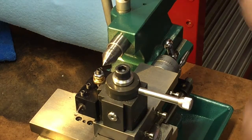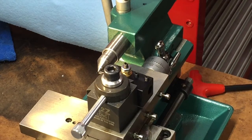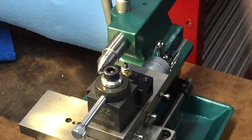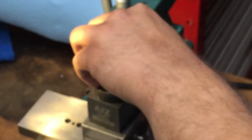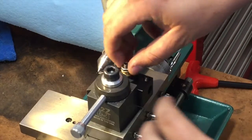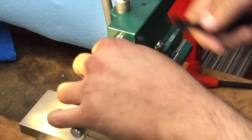The act of setting the tool height utilizing this tool holder isn't fundamentally different from setting it on the other tool holder — just a slightly different method. I install a dead center in the tailstock of the lathe and basically just bring them together to where they meet. Once I have them close enough, re-tighten the tool holder down, unlock, adjust, and lock it up. Once adjusted, lock that nut in place.